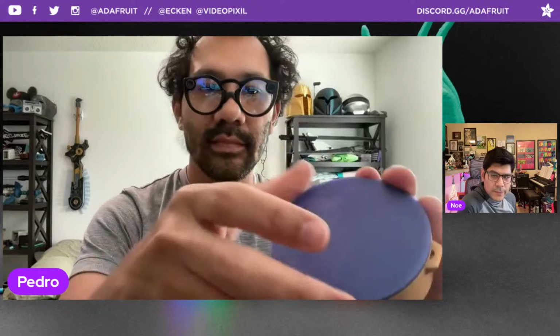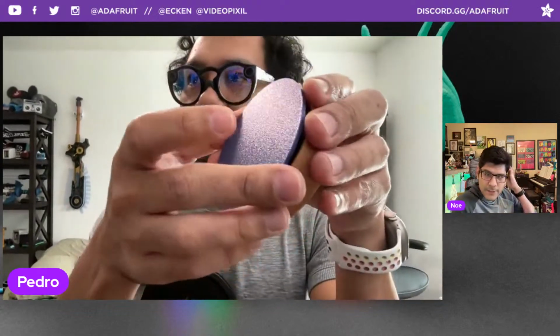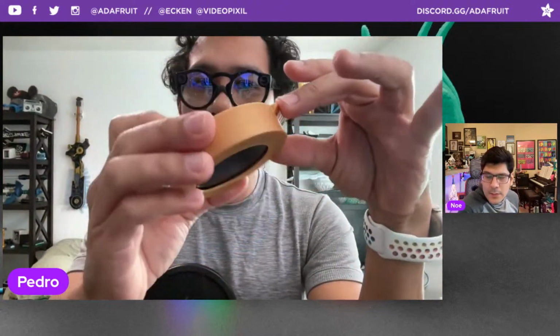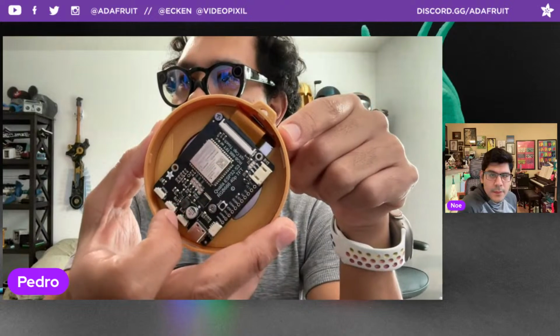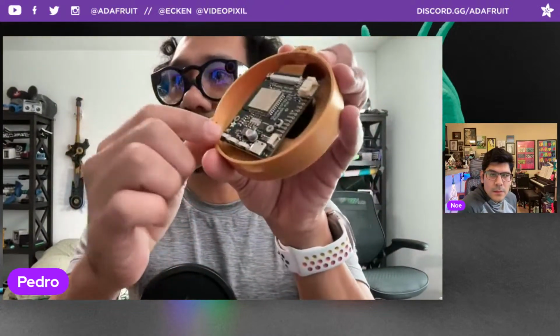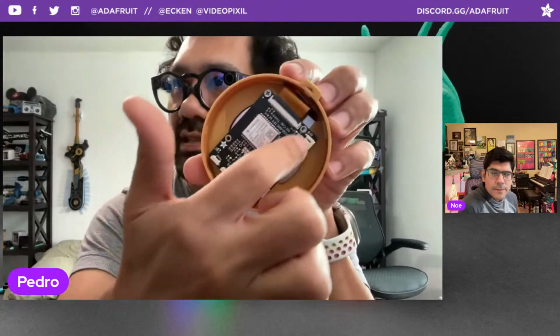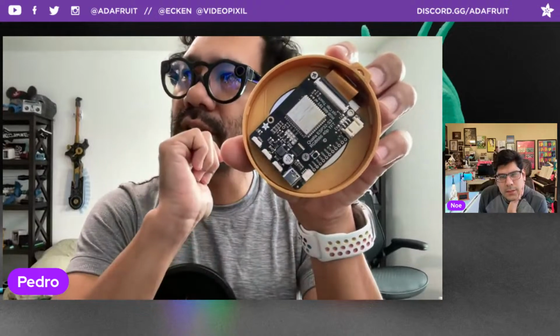So no soldering for this one. So yeah, no soldering. So it should be a simpler way, and it will fit, hopefully, on the internal flash. Some of the design considerations was just making sure that the ribbon cable was not being flexed so much. So I did have to adjust how far away the Qualia board is from where it is positioned on the frame. I think I'm going to have to push a little bit more, but it should be fine there.